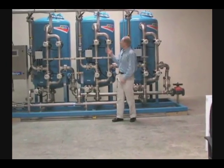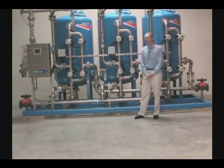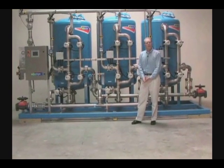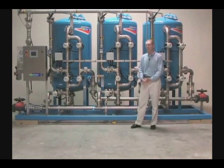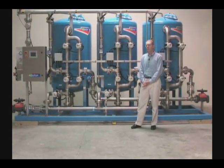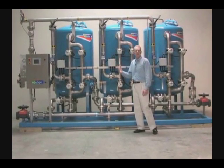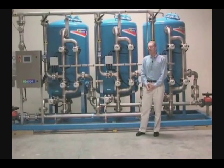We can make many different modifications to suit a particular customer's needs and budget. If you have a certain flow rate — say three, four, or five hundred gallons per minute — we just adjust the number of vessels and the size of those vessels to accommodate that particular flow. There are many other options associated with this type of APU concept.